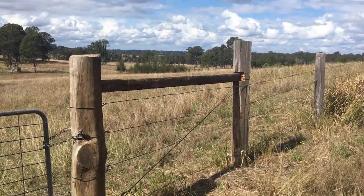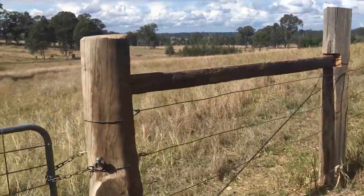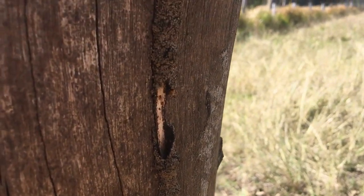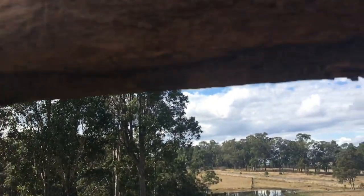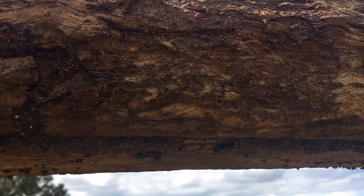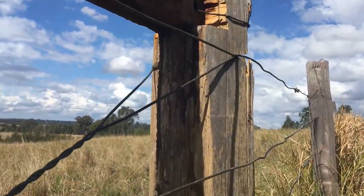Here's the strainer post I put up a couple of weeks ago, pretty similar in construction to the one I just made. See this little track here going up the outside - if I knock them off, there are little termites running in and out. The little buggers go up the outside, across the bottom, and they're eating my rail in there too. They're right through it, all in there mucking about, so I'm going to have to paint this with some sump oil.